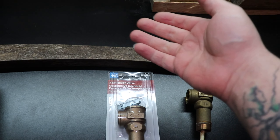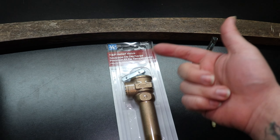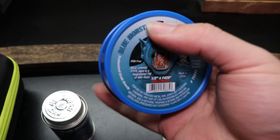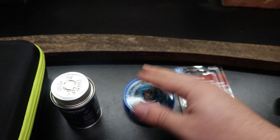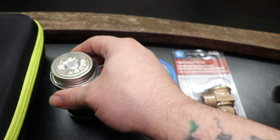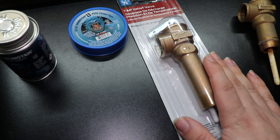If you have your water heater, drain it, flush out all the sediment at the bottom. Don't flush it through here — I only do that because there's no other point in my water heater, but you most likely have a full-size one that will work. Right before we get this done, two things that you will need or are recommended are PTFE tape — Blue Monster is just what I use — and pipe thread sealant. That's going to give a better seal around the threads, keep them from sticking, and keep those threads lubricated so there's no metal-to-metal damage later. Those two things are highly recommended.